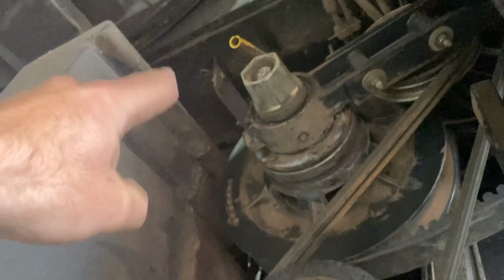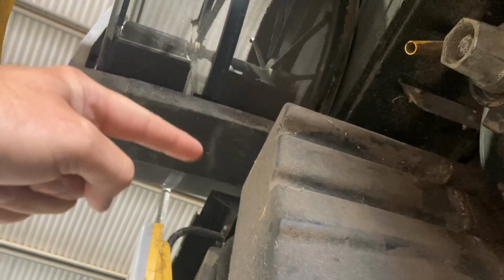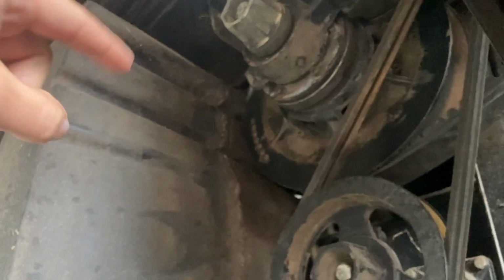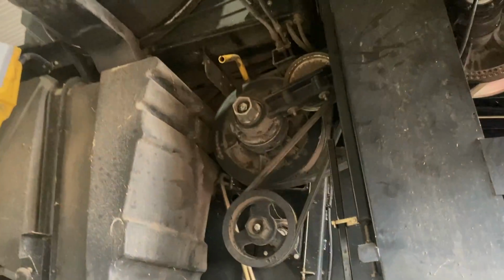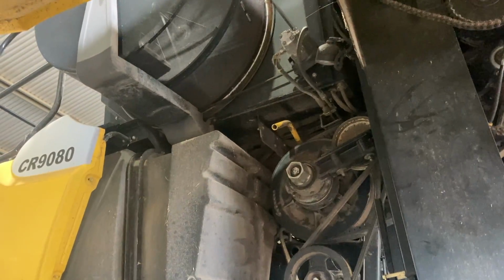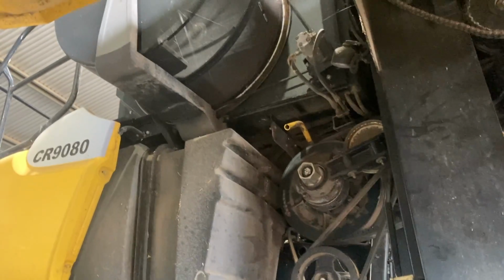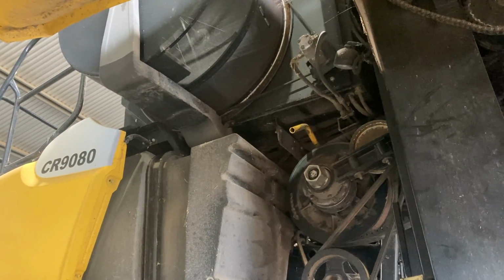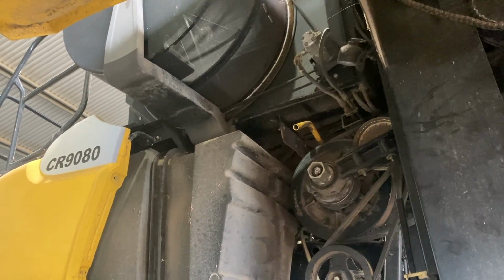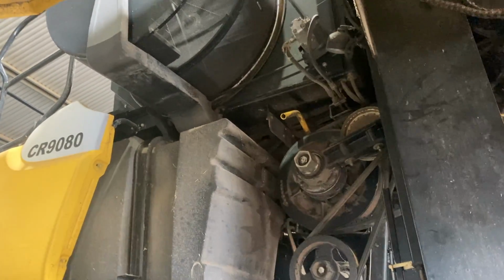underneath the radiator and into the motor. So what happens is all the bugs were getting stuck to that, dropping down there, getting sucked back into there, and then going through the engine fan and absolutely plastering everything with bug guts that were full of oil, which then was heating up on the exhaust manifold or anywhere, and we were having some issues with fires. Not only that, it turned like glue, and we hot washed, degreased everything, the motor, and had to pull a good chunk of it all apart just to try and clean it. It was really bad. So massive improvement.